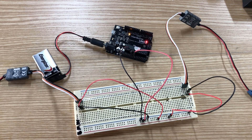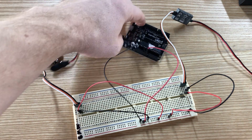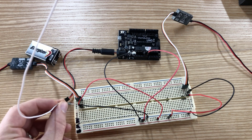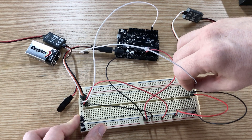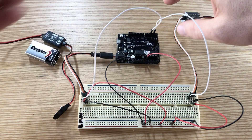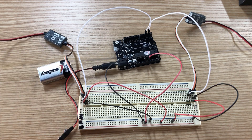The last thing I need to do to control these two motor controllers is send signals to the white wire of each one. I'll arbitrarily connect the motor controller on the left to input pin four, and connect the white signal of the other motor controller to pin two. When I go to program this, the motor on the left is connected to pin four and the motor on the right to pin two. You want to record this information so that when you do your programming, it's all in one place.